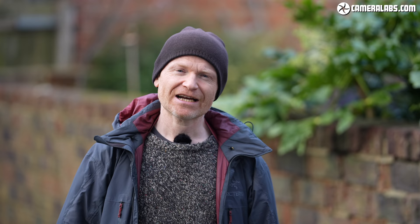Now checking out the safety channel feature of the Wireless Go 2. This records the main signal to one channel and a much quieter, minus 20 dB version to the other channel. If using both microphones simultaneously, those channels have to be merged on one side with the quieter version on the other — meaning you can't separately mix or adjust levels of the two transmitters when the safety channel is enabled. Enabling the safety channel requires connecting the receiver to a computer and using the Rode application. To test this, Gordon is stood about four metres from a Sony Alpha 1 with a 135mm f/1.8 lens, deliberately setting levels too high to see if a usable audio track can be retrieved.